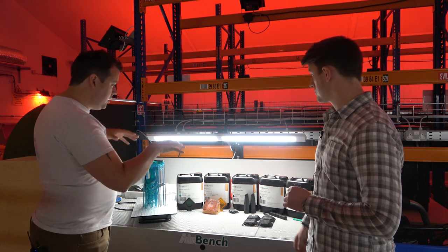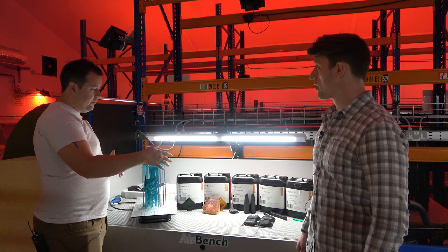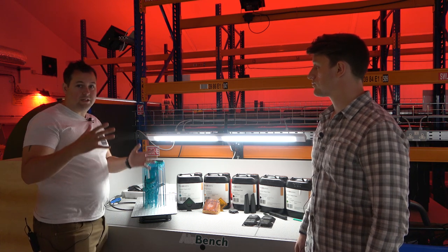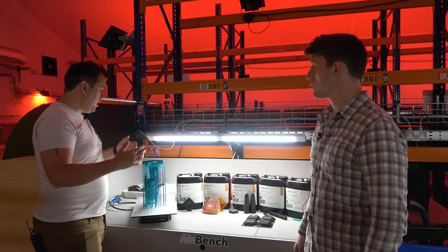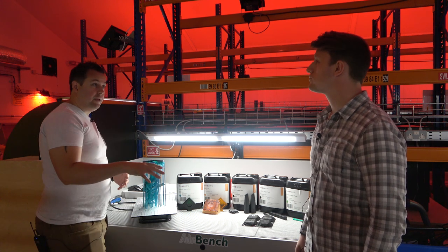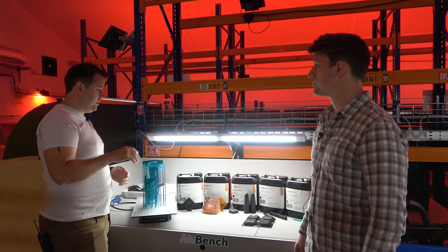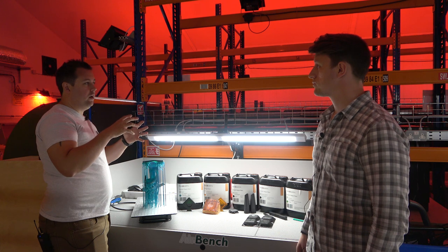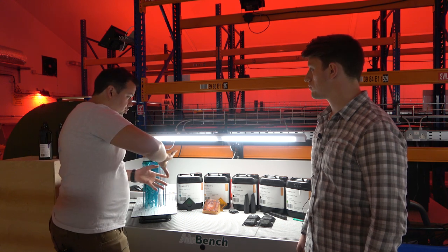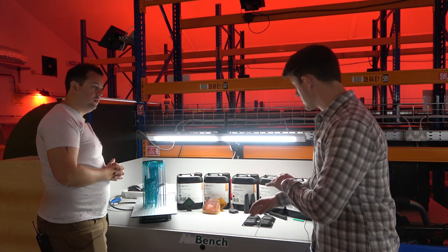It's worth noting that when it comes to these commercial applications of resins, it's really hard to translate that from an FDM world. A lot of viewers have FDM machines, and if they have resin machines they're often small UV resin printers. Someone will probably ask which resin is most like ABS, which has around a 100°C HDT but has good dimensional accuracy and low warp.